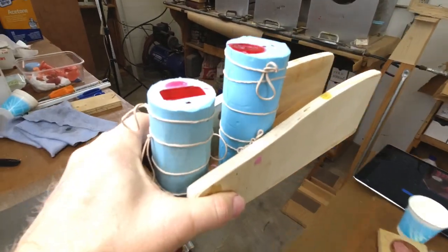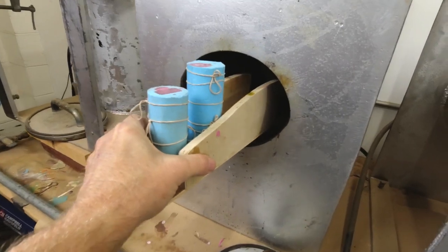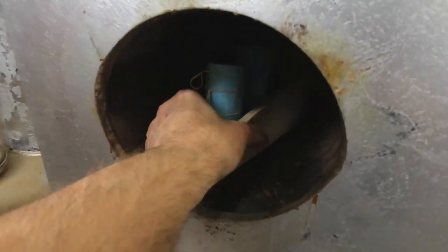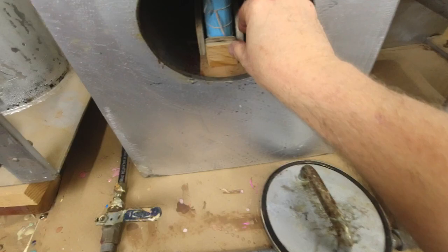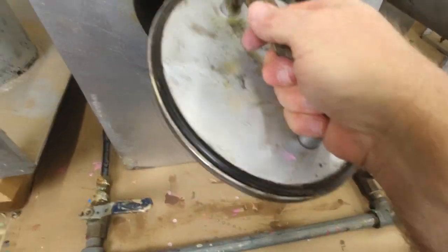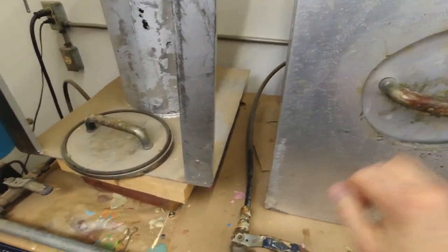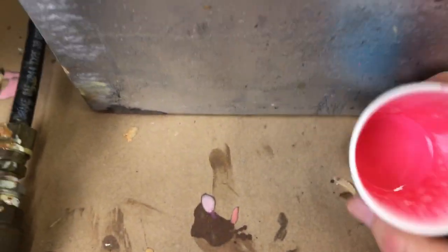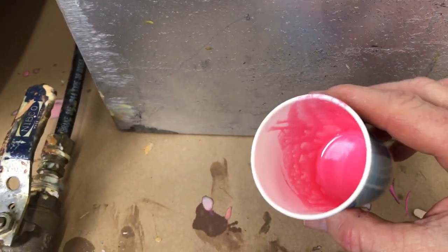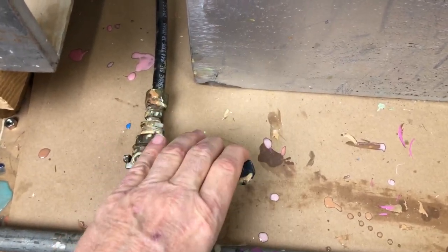Let's get these things into the tank. Put them in the tank, ease them in there. Close out the outlet valve. Let's get the lid on. The witness cup tells all — what's going on in this cup is the same thing that's going on inside the mold. Turn the air inlet off to lock the main tank of the compressor away from the tank. We should be well cured up.